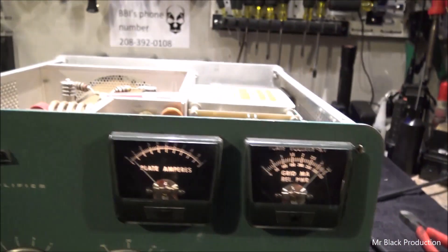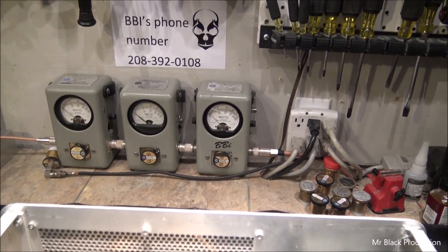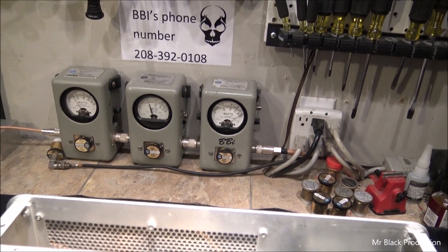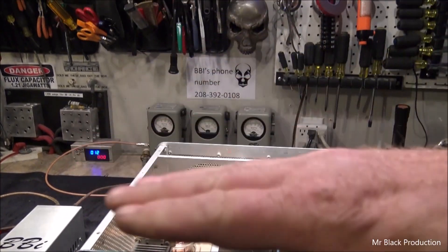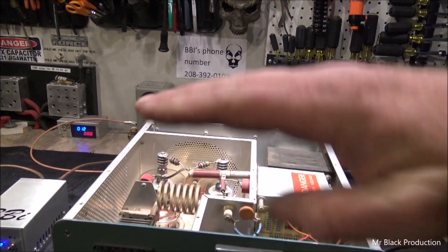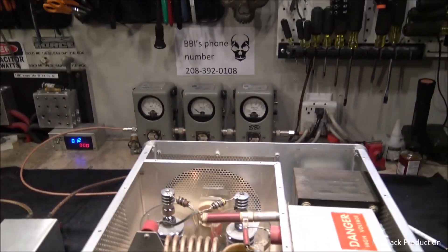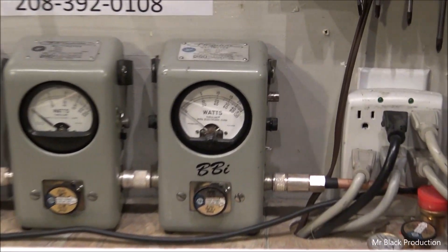Clicking this over to high we're going to increase our plate voltage by 500 volts. Keying up in the corner — now I'm a little leery to stick the camera over the top of the box because there's 3,000 volts on top of that. So we're going to go to the 5x scale.